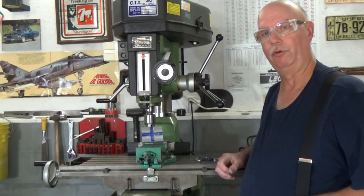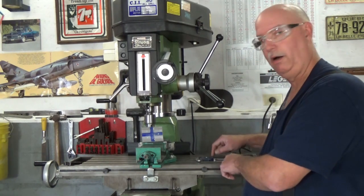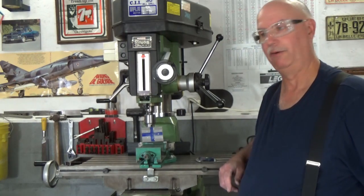And there you have it — a nice bolt hole circle, performed by numbers on a home shop mill without a digital readout, and done quite accurately. I hope you enjoyed that video — I had a great time producing it. It's a bit of a throwback to when I was a young apprentice. Back then, forty to forty-five years ago, digital readouts weren't widespread and we had to do a lot of work by numbers using graduated collars. The DRO-equipped machines were usually taken by the journeymen and the young apprentices had to make do with the rest. Happy machining, and be safe.